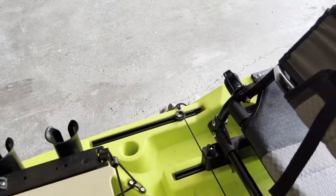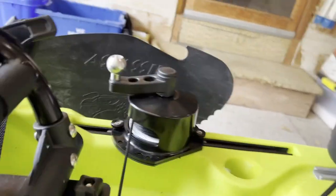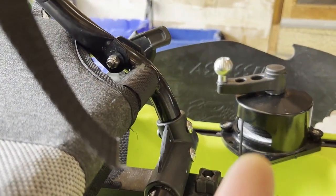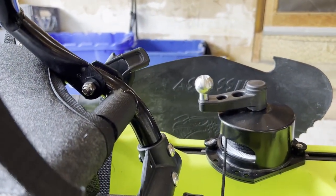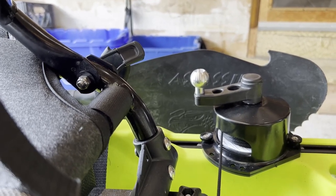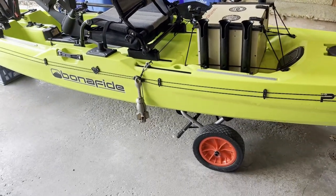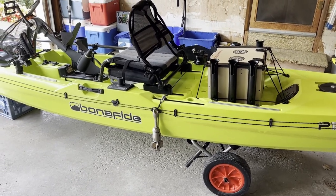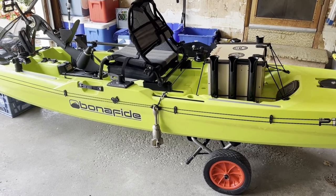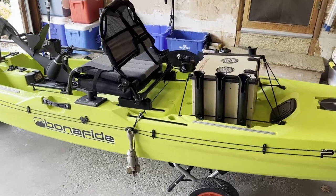I just think that works better. The reason I did it this way is because of the offset on the reel — it's a self-leveling reel, and if you have anything impeding that, it's not going to self-level; the line will stack on top of itself and jam up. This way I can literally leave the anchor hanging just like that when I get on the water. It might cause a little drag but not enough to be noticeable. When I want to anchor, I just reach over, let the tension off the tension knob, and it falls right away.